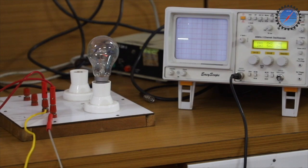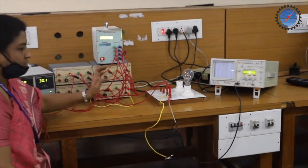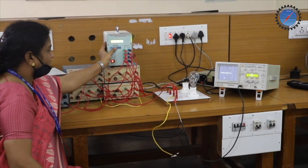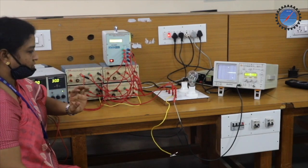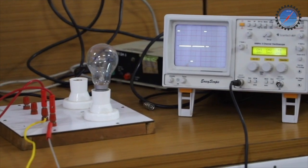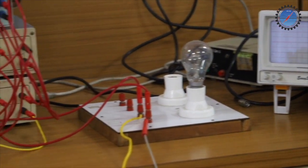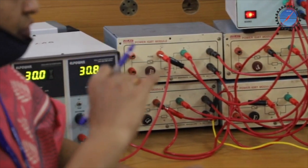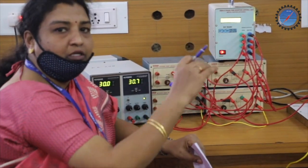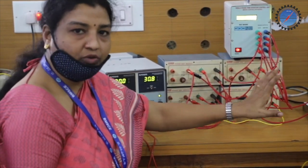This gives a clear picture of what happens when the duty cycle is reduced from 100 percent to 28 percent. If we take duty cycle versus output voltage and plot it, we will get a proper sine wave. But in the lab experiment setup, we will get a quasi square wave as the output, since the inverter converts a DC source into an AC source as per its definition.